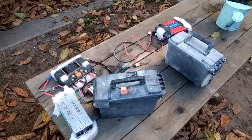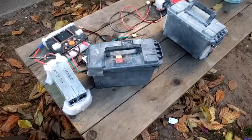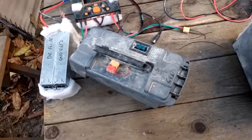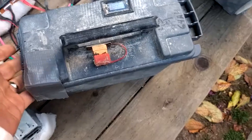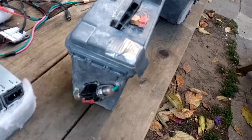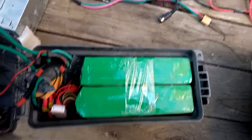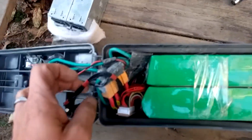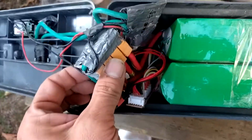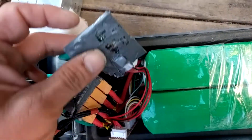There was some interest in my Burning Man setup this year, 2017. I like these ammo cans — they're plastic, from Harbor Freight, cost about five bucks. This is one of my two power bricks: basically 64 amp-hours of 4S LiPos, all wired in parallel with XT90s. This is a battery management board off eBay with a heatsink on it.